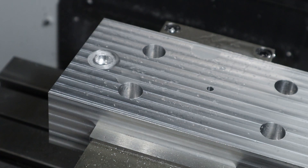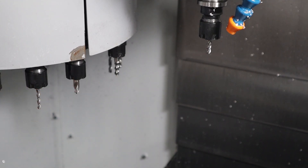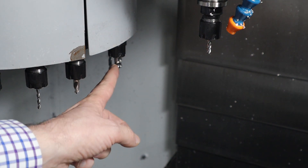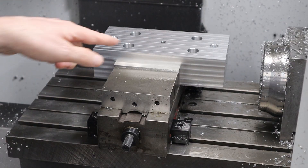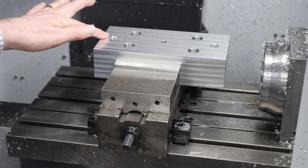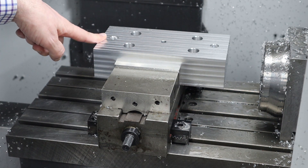What happened was: before I started, I measured the various tools to make sure I had enough clearance, and I measured this one — it has plenty of clearance. But this is not the one I used. I used this one, which, as you saw, did not have the clearance. I took another ten-thousandths of an inch off the top to get rid of the mark that was really bugging me, and now the evidence of my mistake is gone — except for this video.